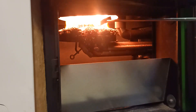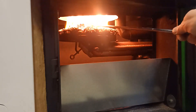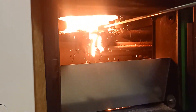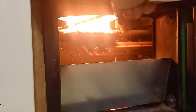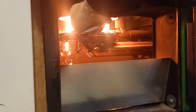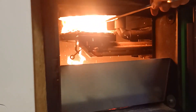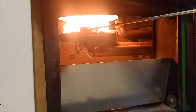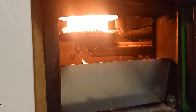The bit we're interested in is this crust here. I'm going to use this tool just to knock this crust off. This is a weekly operation — you wouldn't necessarily do it when it's in full flame, maybe after it's gone out for the day. Just once a week, we clear the crust around the outside; I'm not worried about the pellets in the middle. What that does is ensure that we have no clinker buildup, so that our boiler will keep working effectively.